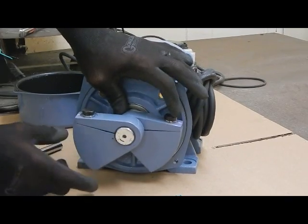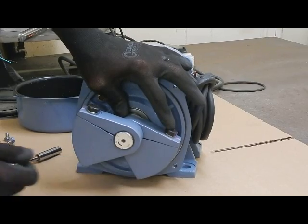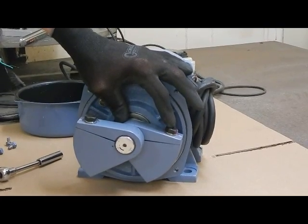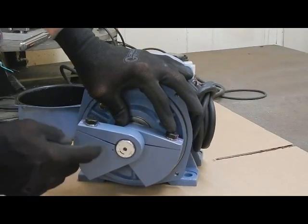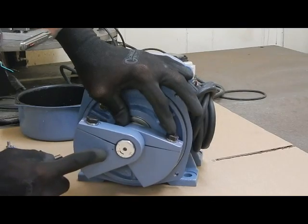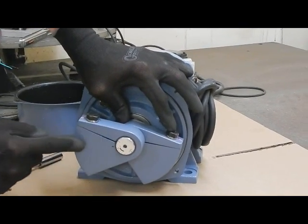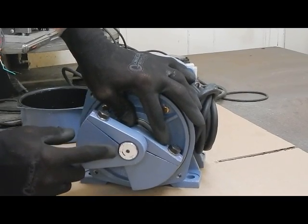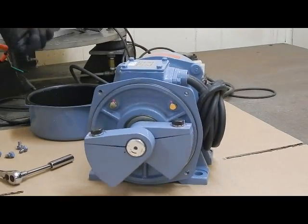You can see there's a dial indicator here on the end of the shaft going from zero to 100%. If you want to adjust the force output of the vibrator, you loosen this bolt and then swing the weight around to change the setting. The current setting is the factory setting — the small punch mark on the weight is lined up with the dial, and right now this is set at 40%, which is the standard factory setting.